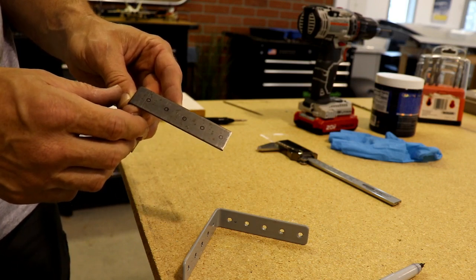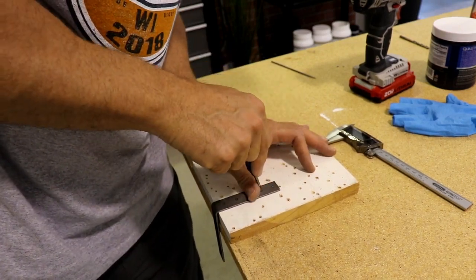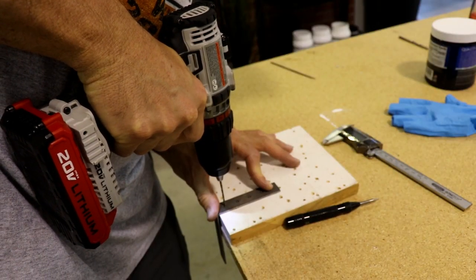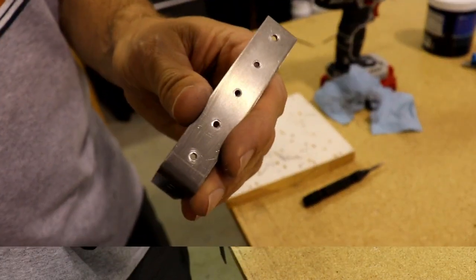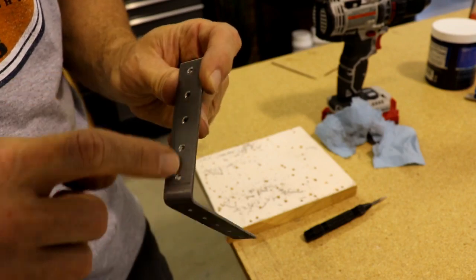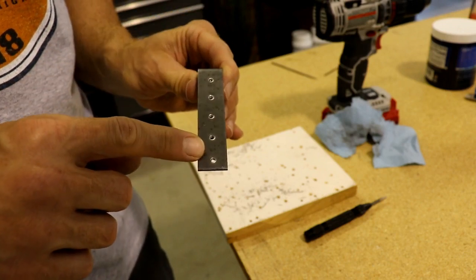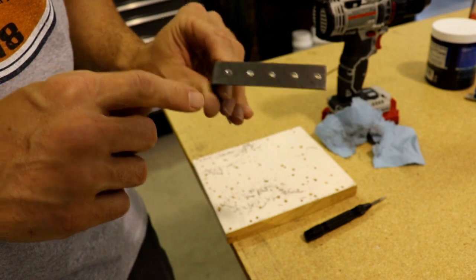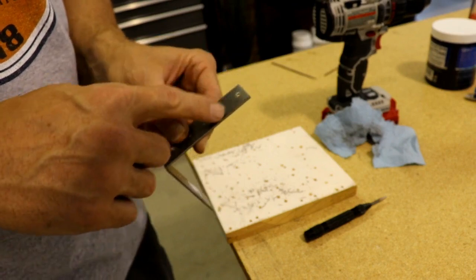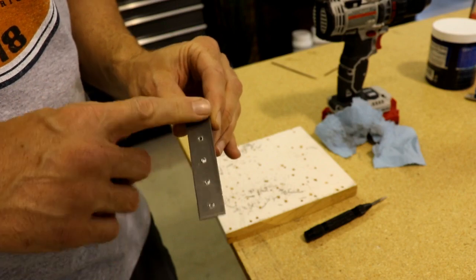I'll punch these and drill them out. I finished drilling this bracket — I've got all five holes drilled on each side. Note that these are only drilled out right now to number 40. I find it much easier to put it in the airplane and match drill all these holes at number 40, and then once they're all match drilled, I can go and open them up to number 30 and then to number 20. So it's up to you, but I find it a little bit easier to do it that way.